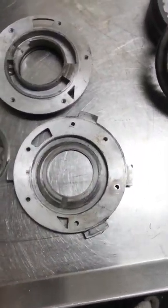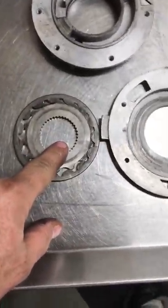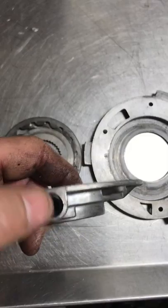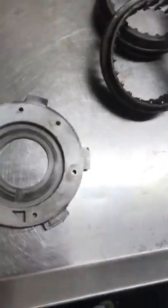One of the things that happen is this here — this is the old pump. It's basically a low gravity circulating pump. Once assembled, the shaft rides here. As the shaft turns, it creates a low volume pressure which picks up fluid from the lowest point, pumps it into the main shaft via all these little holes, and that is what lubes the entire unit. It runs out, runs back down, and recycles.